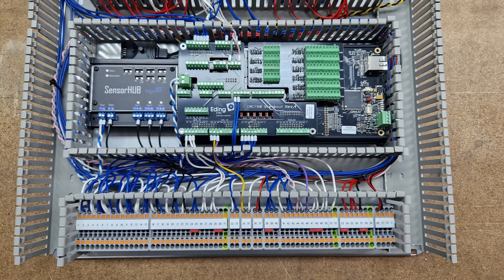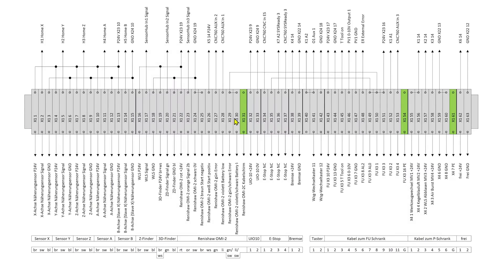The interface to the machine is just a row of push-in terminals for a direct connection of the cables coming from the machine to the controller. I have a stationary setup, and using connectors between the machine and the controller cabinet does not make a lot of sense to me. I have divided the terminals with separators to easily identify what goes where, and I also document this in a terminal plan, marking which cables connect to the terminals. On the far left are all the homing sensors, then a few terminals for different toolsetter and touch probe options, the e-stop switch, Z-axis brake, manual tool release button, and the connections to the spindle VFD and the pneumatic cabinet.